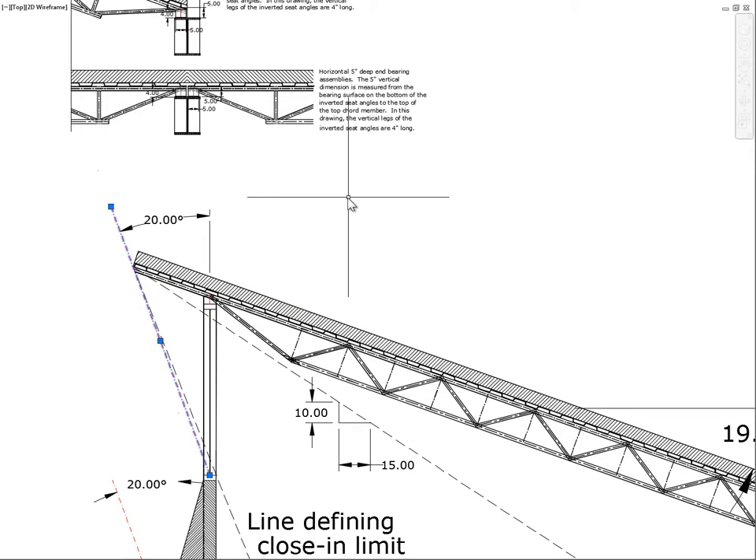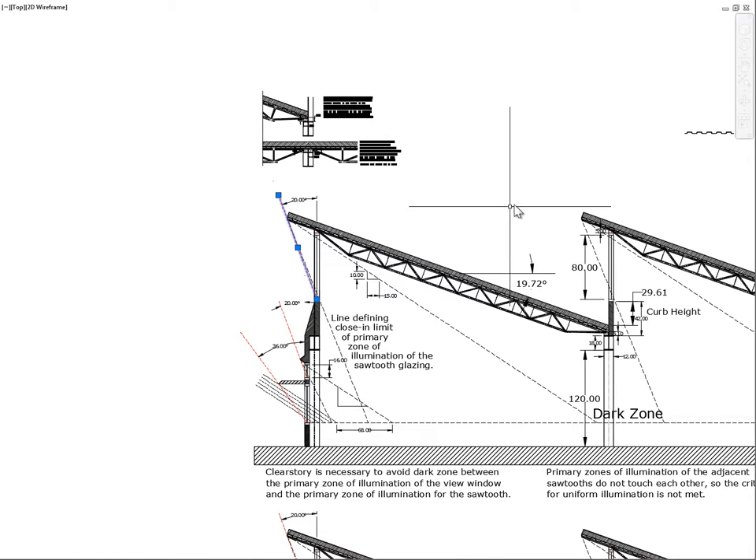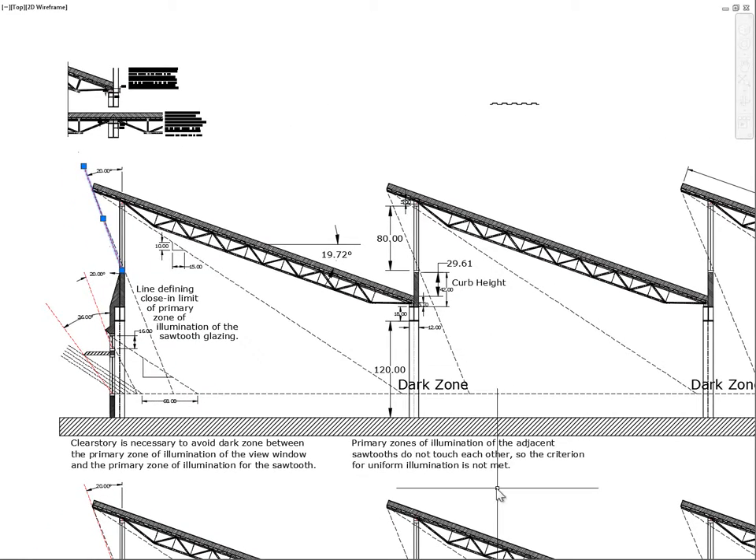Typically on the outer edge of the overhang, an angle is added to reinforce the decking and contain the insulation. That angle is not strictly necessary for spanning, but localized loads (such as ladders or people hanging on the edge) are handled by this edge angle, which can be as deep as the insulation plus the decking thickness. Once that outer edge is established, it can be replicated throughout the structure.